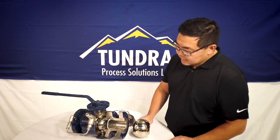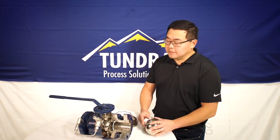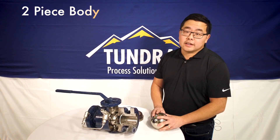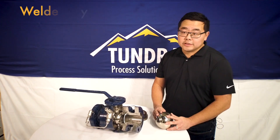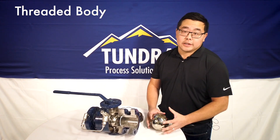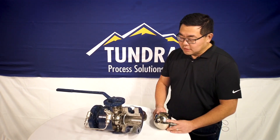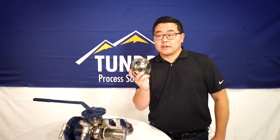It's a very good valve. These valves come in multiple different body configurations. This one is a three-piece body. They also come in a two-piece body with a top entry or side entry, a welded body, and I have seen some small trunnion-mounted ball valves that come in a threaded body. Overall, they all do one thing: getting this ball valve to turn 90 degrees in order to allow or prevent flow.